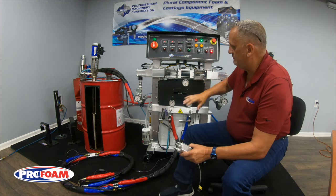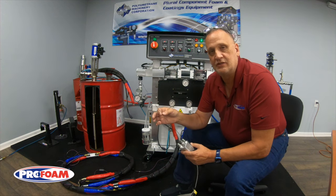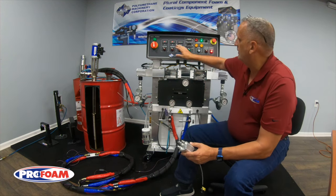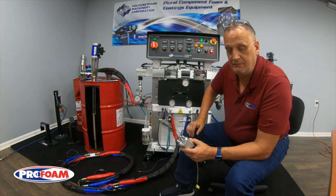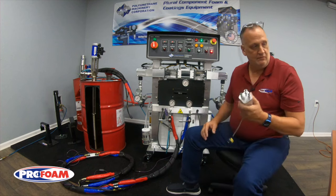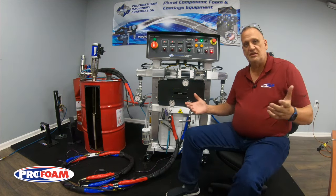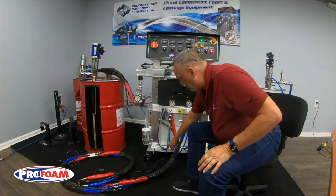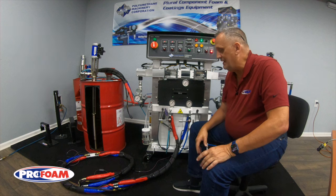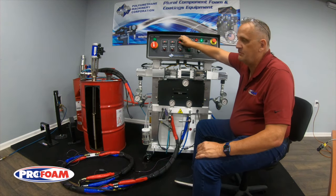When it's flashing, for some reason it has no connection to that wire anymore, so it's telling you it doesn't know what's going on — it's going to stop feeding heat out there and flash this error code so you know you've got a problem to fix. The error could be the sensor itself or something on that purple wire that runs out along the hose to the sensor. It's really unlikely to actually be the controller itself.